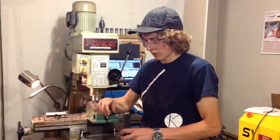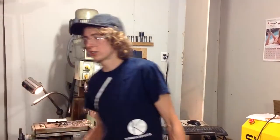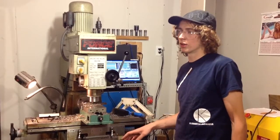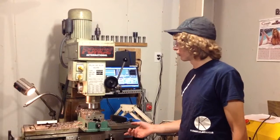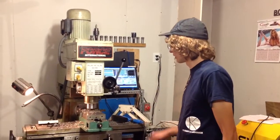So I'm doing 100 thou at a time, and my material is 500 thou deep, so it takes 5 passes to cut the full depth. That's about as fast as this mill would go without the servos on, so it's just as feasible with the CNC conversion as it was before, but now it doesn't work completely manually.